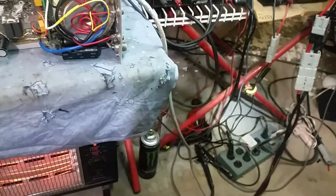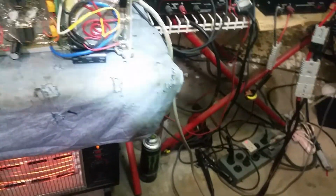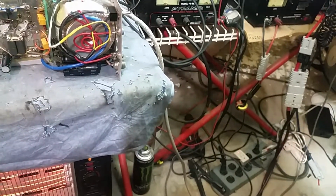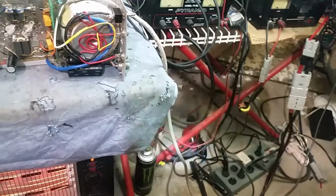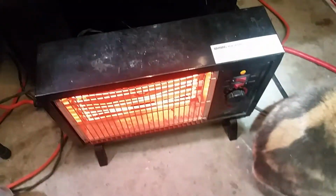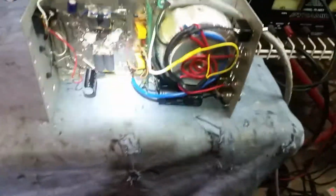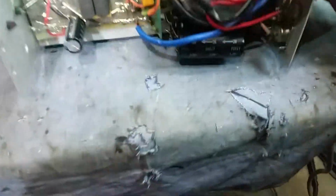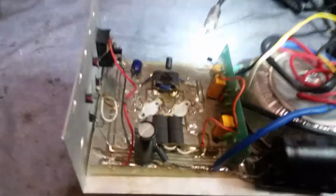Had to take the switch out of it. When it falls over, you know, it turns off. So it's just not a safe heater. And I had to repair 2 other things in it and installed some fans on the bottom of it too to blow some air out. I just had to bypass the thermostat in this one right here because the thermostat switch went out. Goodness gracious. So anyway, we got a Gray 200 right here, and this thing's in a mess.